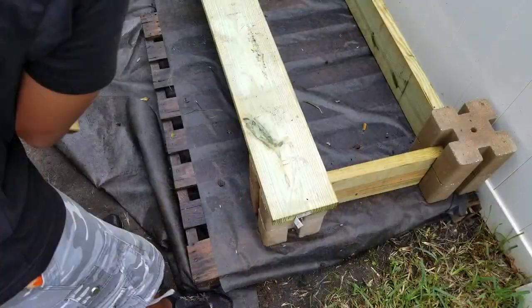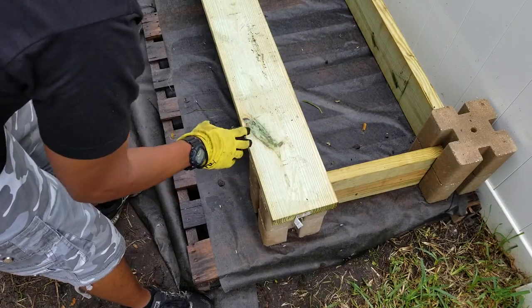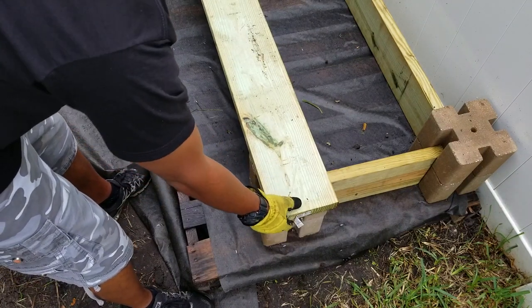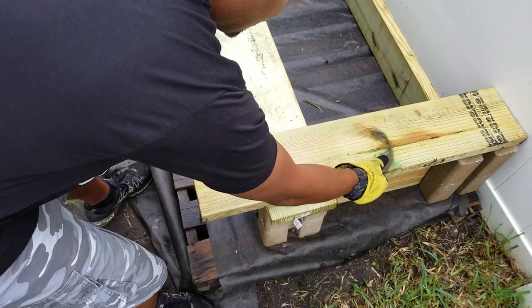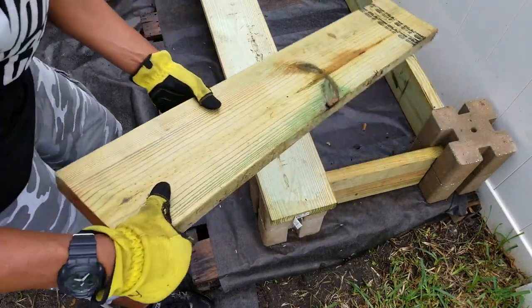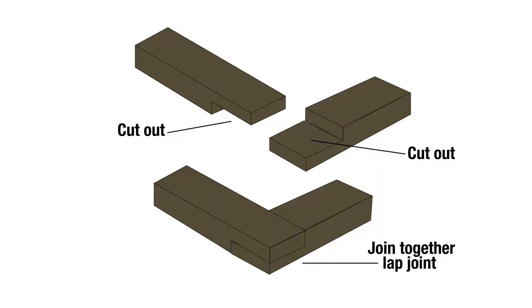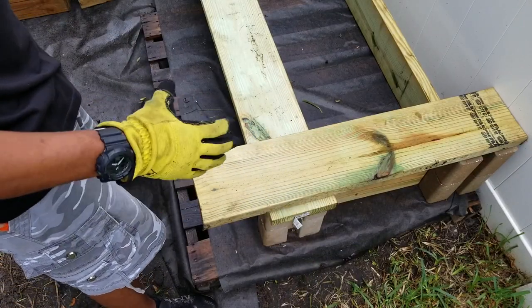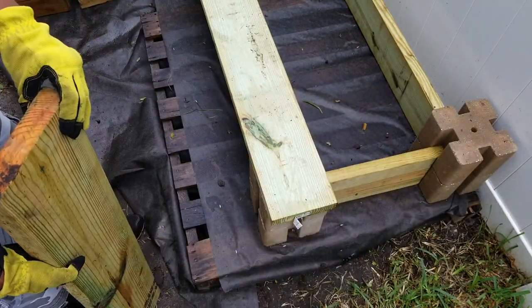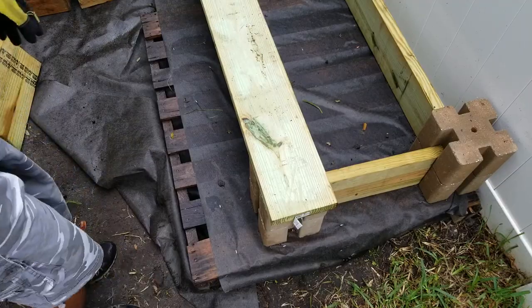What we're going to do first is cut these boards out and get that all situated. The plan is to take a piece of wood, run it down, and use it as a work platform. I need to run this one down — that's pretty simple. But I want another board going across over here, and to do that I'm going to do what's called a lap joint. I'm going to join two pieces of wood by cutting this board in half, cut a chunk out, do the same thing on the other board, put the joints on top of each other to form the joint. I want to keep everything mobile so I can tear it down or reconfigure it easily.